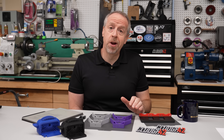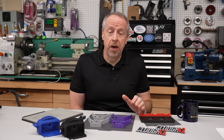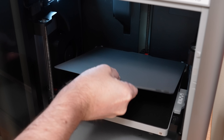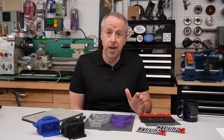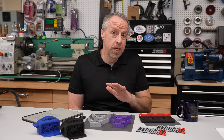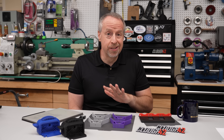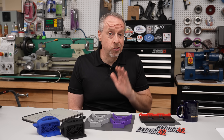So should you rush out right now and buy one of these plates with my affiliate link? Probably. The only real complaint I have is that it is a little bit difficult to position on the magnetic bed inside the X1 and the other enclosed Bambu printers. Since the surface is kind of tacky, once the back edge sticks to the magnets, it's actually kind of hard to slide it around to position it properly in the guides — it definitely takes some practice. For me, I think this is going to be my new go-to plate for PLA and PETG when I don't specifically want a textured surface. The bed adhesion is fantastic, and that should make things a lot easier because I design a lot of parts with irregular shapes and acute outside angles on the first layer — I know I really shouldn't, but I do it all the time.